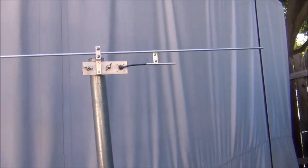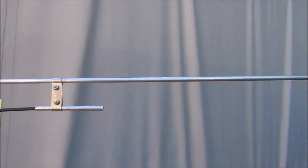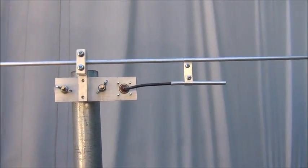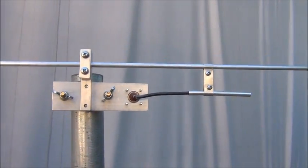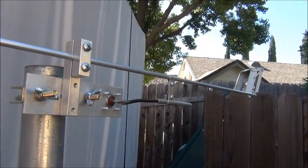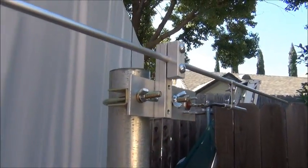In just a moment I'll show you a prototype that I've made. Although it's in the shape of a dipole right now, it's not circular in shape yet. Here's the prototype antenna — it's still in the form of a dipole and it works quite well. This particular antenna design is made so that the radiating element is all one solid piece. You don't have to have it split in the center like a normal dipole. So this is the radiating element and it will be bent into a circle. There's the bracket that holds the radiating element, and this is the bracket that holds it to attach it to the U-clamp that bolts onto the pole that will go up in the air.